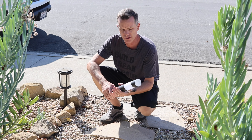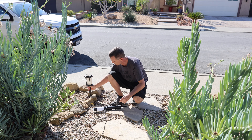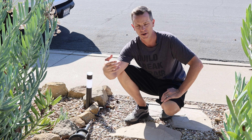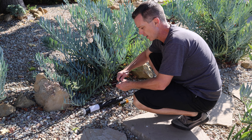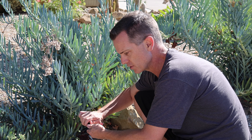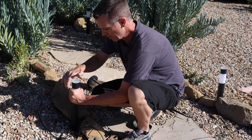Before running wires and digging things in, make sure you have the correct runs planned. I ran the wire for the landscape lights and know I need to hook into one spot where I'm replacing an existing light — the old one comes out and the new one goes right in its place. Work your way up toward the house and power connection. When you tighten the connectors down, there's a little gasket — make sure everything is fully seated and really tightened to make a waterproof connection. Right now I have all wires sitting above ground; we will bury them in.